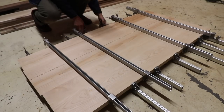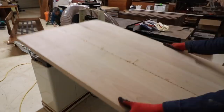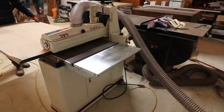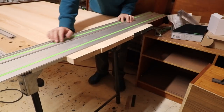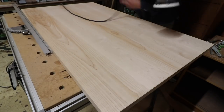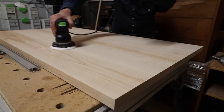After it was all glued together I needed to sand some more, so I put it on the sander again. This sander is open-ended, so as I push it through the drum sander I can flip it over and do the other side to create a flat surface. Then I used a track saw to square up the sides, and finished with an orbital sander, sanding it down to about 320 grit for a super smooth finish.